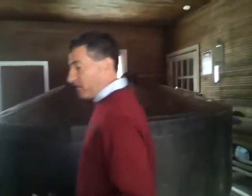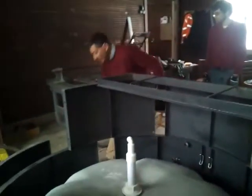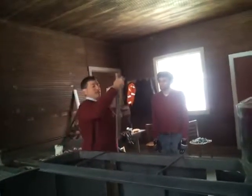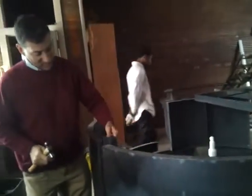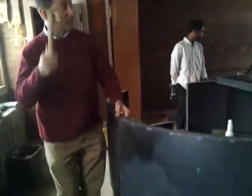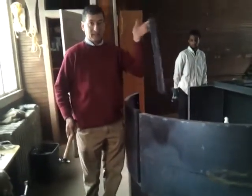Note that the center piece — that piece that you moved out — every one of the molds has a gap piece like this, which is the last piece in and the first piece out. You can see how it's angled as a wedge so that at the end you can come in and make sure everything fits right. Because it's wedged, you put it in and it fits in. And then when you need to get it out, you just pull and it comes out.